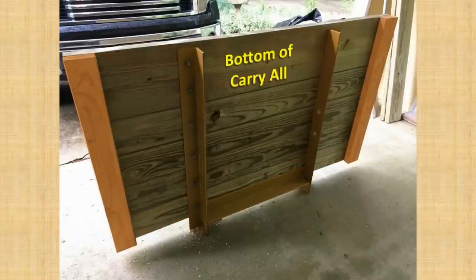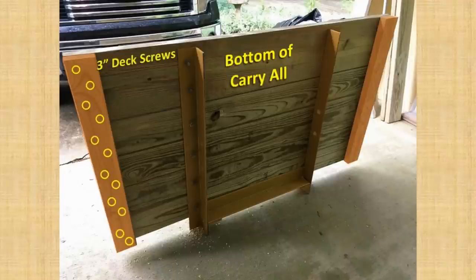Once the bottom boards were mounted, I attached 2x4s to the underside of the platform boards to keep the ends of the boards in line, since pressure treated lumber has a tendency to warp when it dries out. The 2x4s are attached using 3-inch coated deck screws in a staggered pattern. I also added 2x4s to the back side of the back boards in the same way.